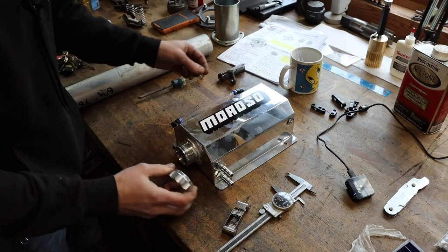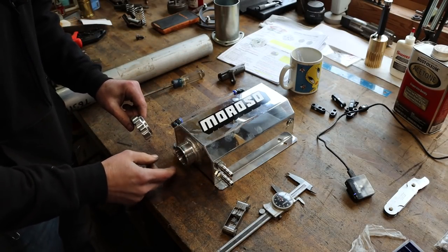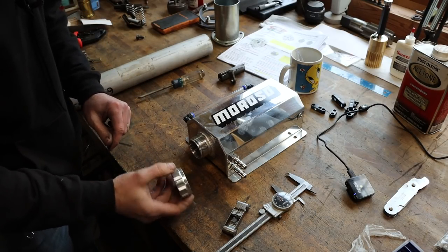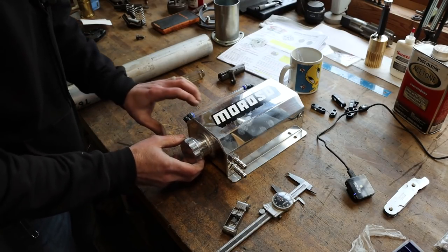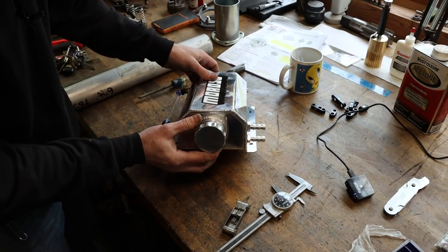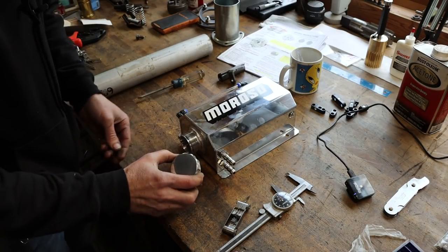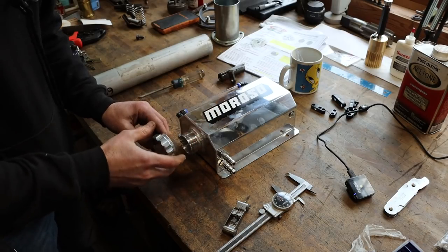And what I want to do, like I mentioned, is replicate this cap, because I think it will work really well for my valve covers. Inch and a half on the inside diameter, so you could just jam a quart of oil down in there. You know, no funnel needed, right? Got a nice O-ring seal, so that should hold this in place and seal it well. 60 degree thread, so it should be pretty easy to just make a new one. Plus we got a nice flat surface on the top, and you know, Elizabeth maybe can do some magic on that with her laser engraver and customize it a little bit farther. So let's go over the lathe and see if we can't make us a new weld-on bung for our valve cover.